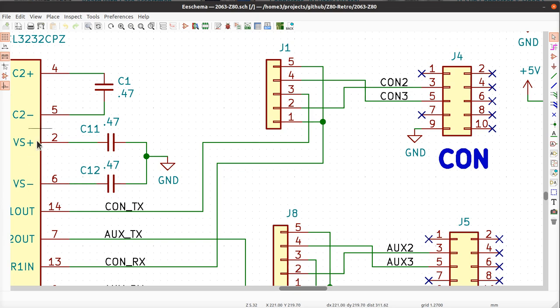Remember, this is the RS-232 level shifter, and the transmit and receive signals go into this connector. And they do it in a way so that if I take a jumper and connect 5 and 4 together, and another shunt and connect 2 and 3 together here, what I'm doing is connecting this wire here, which is transmit in that scenario, to go over to pin 3 on this header here. And this receive line would come up and go to this other one over here, pin 5, all right?